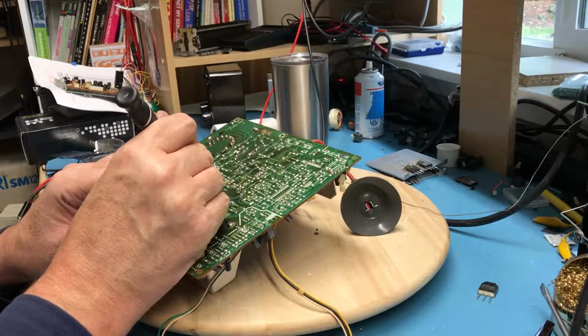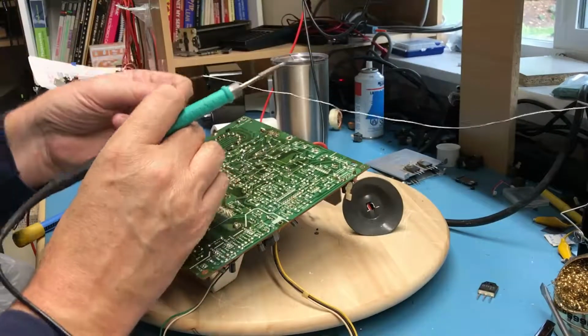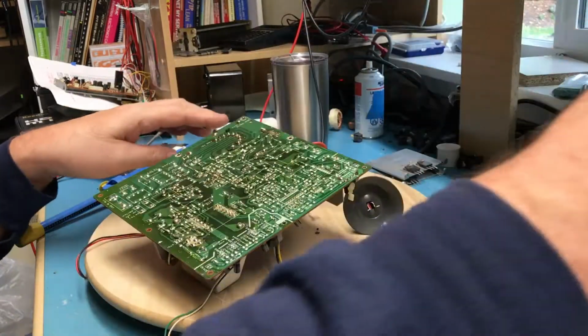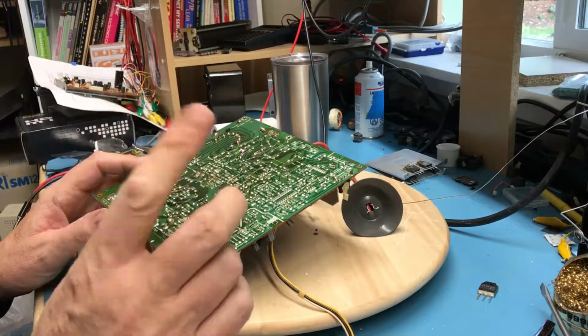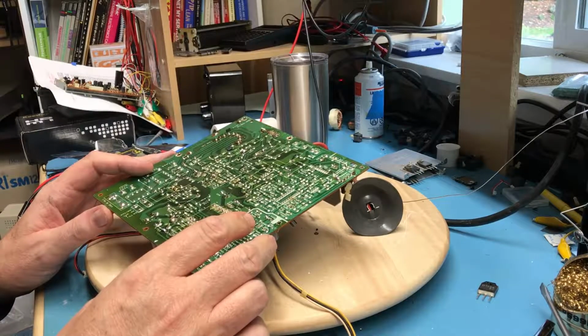Go ahead and kind of bend the pin back over the way it was. Yeah, with a plated through hole, you of course couldn't do that. It'd be impossible to fully isolate that pin, but with this just being a single-sided non-plated through board, just getting the pin up through the hole kind of centered so it's not touching anything was enough to isolate it.